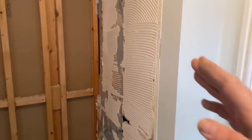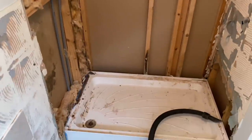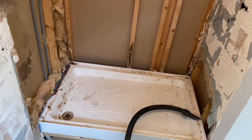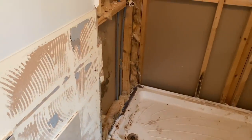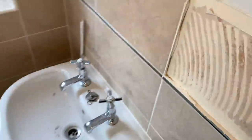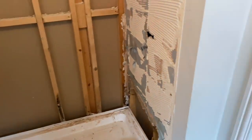Because we're going to move this back I'm just going to completely reboard all that in moisture board, ready for tiling. We've got that out, we'll just clean this up now — hoover it up, keep it nice and tidy — get the tray out, cap the pipes off, get the rest of the tiles off, get the rest of the suite out. Then we can start first-fixing.